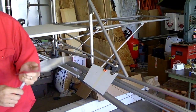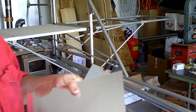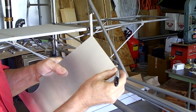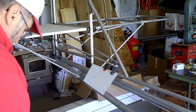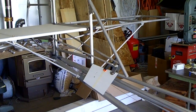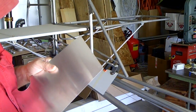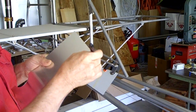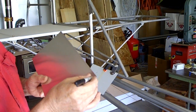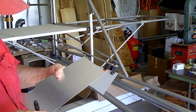The first step — I'll get in closer here so you can see what I'm doing. I'll take and mark with our magic marker. Just put your finger on the edge of the metal and then draw a reference line. My marker is not working. Sometimes these magic markers get a little dried up, so just put your finger on here, go in a quarter of an inch, and follow the seam right along the edge. This is going to be my mark for my rivets that I'm going to be putting in here to hold this plate on the fuselage.